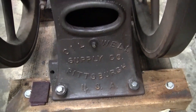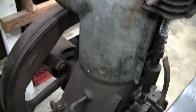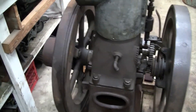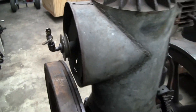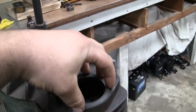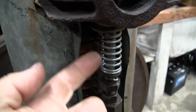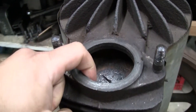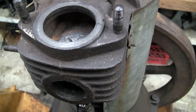It's an Oil Well Supply out of Pittsburgh, Pennsylvania. It's a four-horsepower engine, 450 RPM. I've had this thing for a while and really haven't done anything with it. You can see there's a little fan in here to cool the cylinder. The intake valve assembly bolts right onto the top here. This is the exhaust valve here — you can see the exhaust port, the stem, and all the gearing down below. Although it looks a little rough, the seat and the face of the valve cleaned up pretty well.